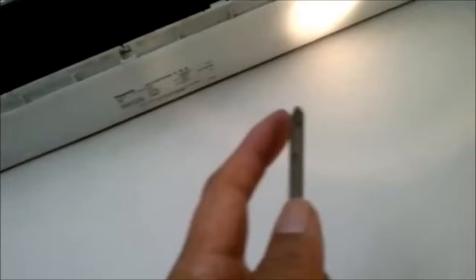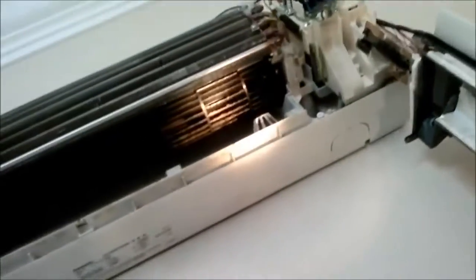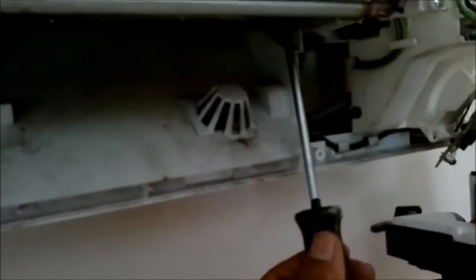But make sure that you use a good screwdriver, the right size. Okay, if it's blunt or you see that your tip here is worn out, please don't use it. Get a fresh one, because this tip is extremely important, because if it's not sharp, you tend to shear the head away. So okay, remember to use some strong force with two hands holding the coil at the top and one hand on the screwdriver, and press it in and turn it around until it's out. And now, as you can see, there's another screw that's mounting the coil. It's only one screw that's mounting the coil.